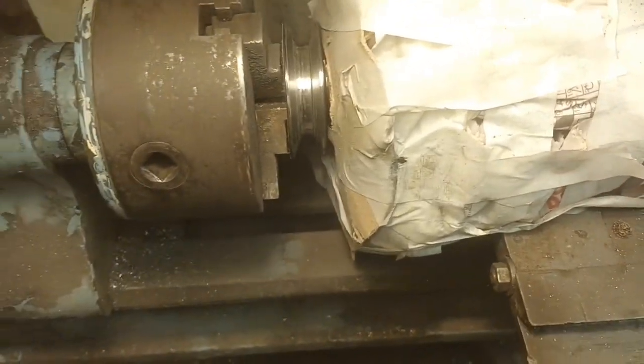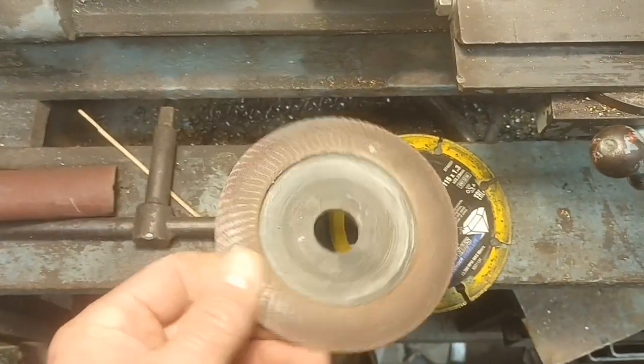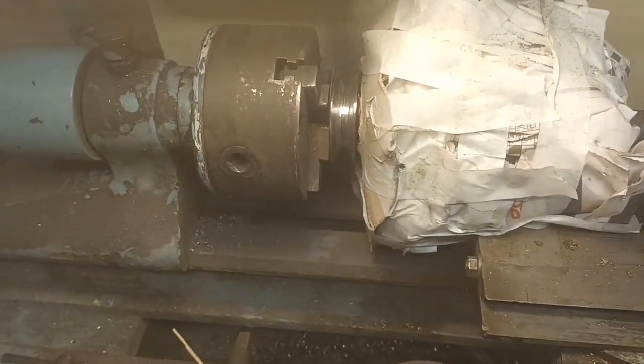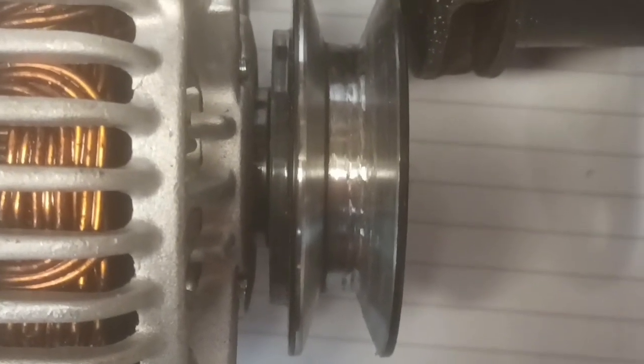That's widened up quite a bit there. That's a combination of just spinning in the lathe - spinning the shaft on the centre - a combination of a diamond-tipped blade and then some flap discs and then finishing off with some emery. I didn't film that because somebody will shut me down for health and safety, but anyway that's worked and that's wide enough. Those pulleys are pretty much the same width at the top, maybe not quite the same angle, but that's near enough. A bit rough at the bottom of the pulley but the belt never touches that, so that'll be alright.